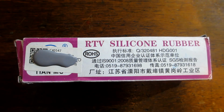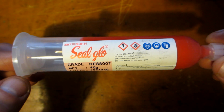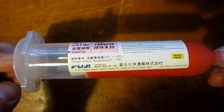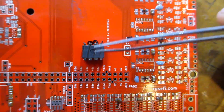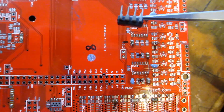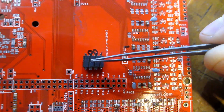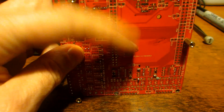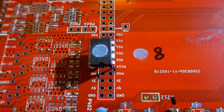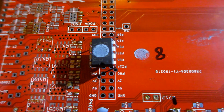Just a side note on the cheap thermal glue, I figured $12 to $20 for the red glue is a bit expensive, and everyone has that cheap glue hanging around, so I was wondering if it would work. And it kind of works if cured before going in the oven, or if wet, in a very thin amount. Tiny amounts seem fine, but big blobs seem to expand like a balloon. It holds pretty well after an oven heat. This was zero clearance, unlike the gap under an SMD part, so it squashed out a lot. Either way, if you want to use it, maybe experiment on it first.